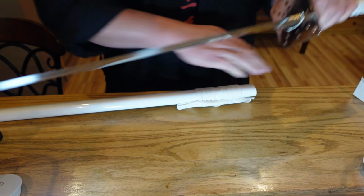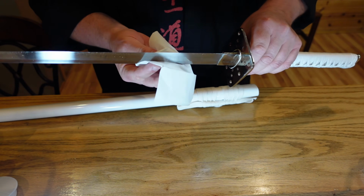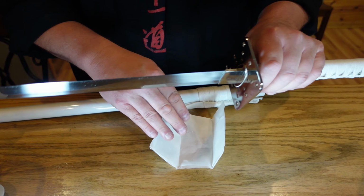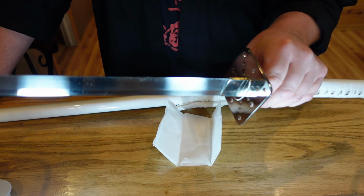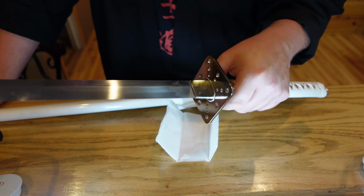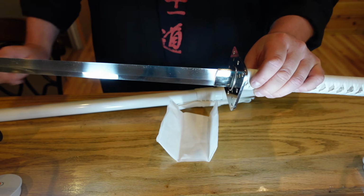This is an unbelievably sharp sword here. It has a really good edge. So this steel is very well known for having really good edge retention. When you cut targets, it's going to hold your edge, and it resists abrasion and corrosion, unlike many of the other steels. So 9260 steel is really good. It has a good Rockwell hardness, and I think it's like a 61 on the Rockwell scale. So if we're going through hard targets, it's going to do very, very well.